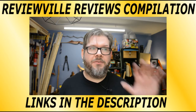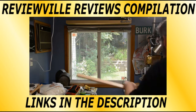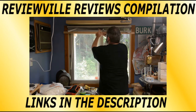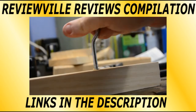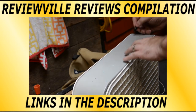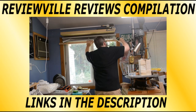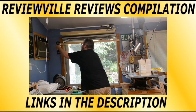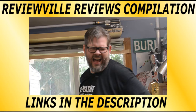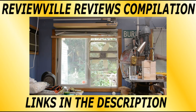Measure the distance across your window frame and then find a piece of wood that matches that dimension. Hold it up, open the window, and mark exactly where that open window space is on that piece of wood. Grab two screw hooks and put them into the wood in that open window space. Take the measurements between those two screw hooks and transcribe that onto a box fan, and screw out those two holes. Affix the piece of wood to the window frame, then hang the fan from those hooks, plug it in, and bada-boom — ventilation.